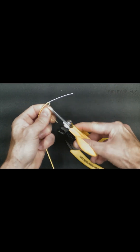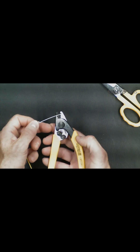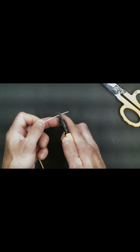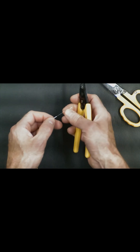Next, place the 600–900 micron tight buffer into the second hole. Squeeze the jaws together tightly and push the tool away, and you'll remove the buffer tube coating cleanly. Notice the clean cut transitioning from the 900–250 micron.